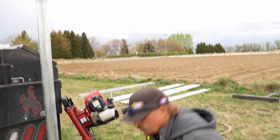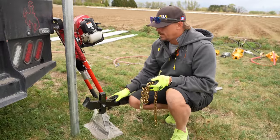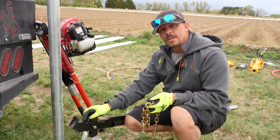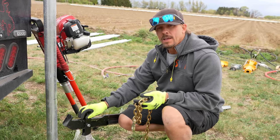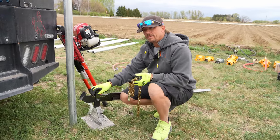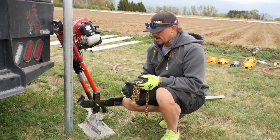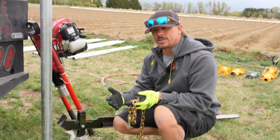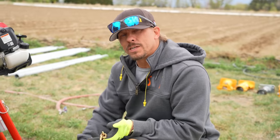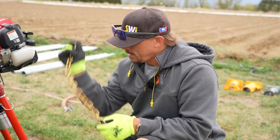This is the Strait-Right post puller. We like it in Florida because it's light — it fits right down the channels of our frames, we can put it on the truck. It's not some great big massive deal to carry around, and it works very well. In Florida, this will pull just about any post that anybody has set anywhere. We have sand, we have a lot of poorly set posts — maybe one bag, maybe a bag and a half of concrete if you really want to do it right. Most of those posts you can actually pull out by hand. The posts we drive probably pose more of a challenge because we're sinking posts four feet plus, compared to others going maybe two feet deep.